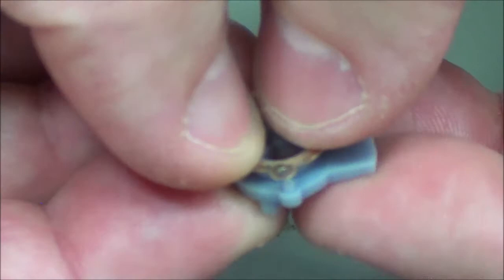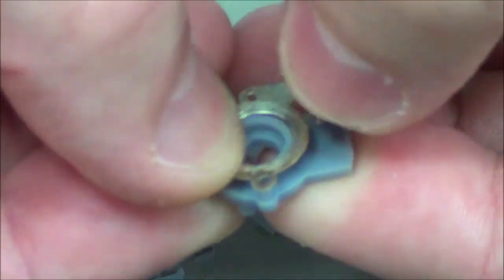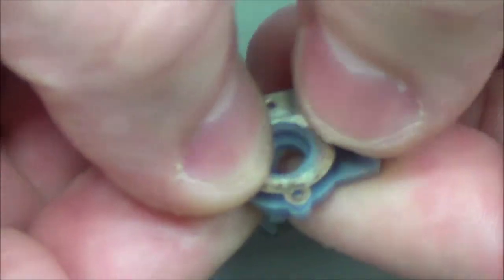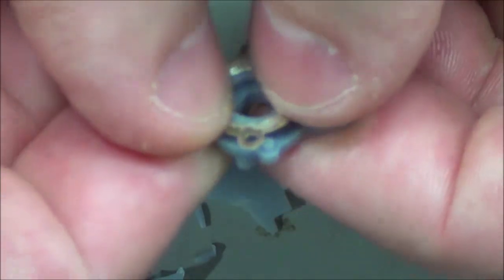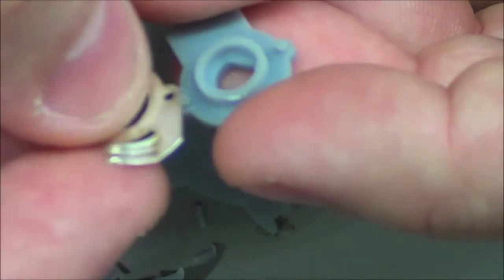Did it drop in? I wonder if I can squeeze it on, or if I might just have to bring in the outer dimension of that ring. Yeah, I think it's actually a little too big, because this metal piece is not going to snap on. And again, I can fix that and reprint it. It really doesn't take that long. Sometimes you can fit these things over. But all right, so I went a little big on the tolerances. Let me just see if the pins work.